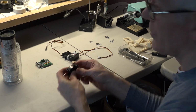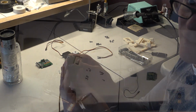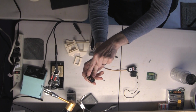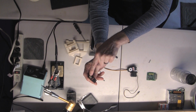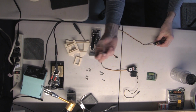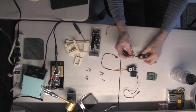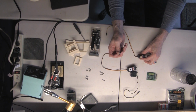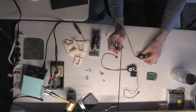And if you can see that, it's hard to see with that light. Let's see, maybe here. You can see there's the set screw. And the set screw is facing the open part of the square, because that's going to go down and press down on this shaft. Now, when you get these shafts, one side is going to be cut, and I do my best to smooth it down and make it slick. But the machine cut one that it comes with on the top is the smoothest end, and that should be the one that sticks out.